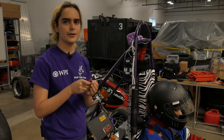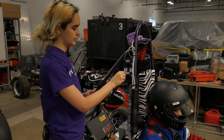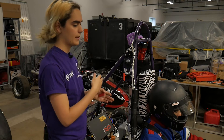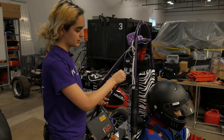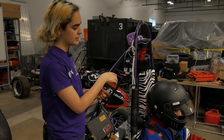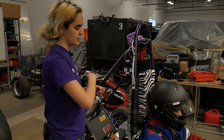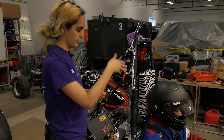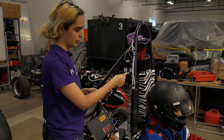So these are the car keys — they're these little red plastic pieces that go into these switches and then turn them on. First you're going to want to turn the main GLV systems of the car on, so we're going to insert this key and then turn it to the on position. For any switch like this, it's mandated by the rules that the position where it's going forward to back of the car is the on position, and then the one where it's going either up and down or side to side is the off position. So we're going to turn it on.